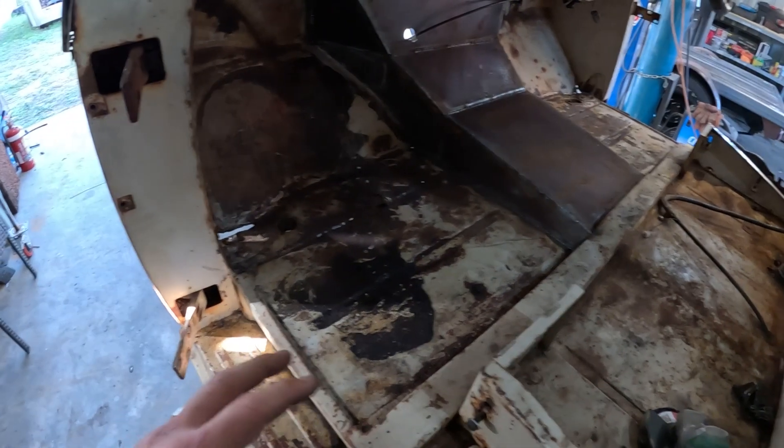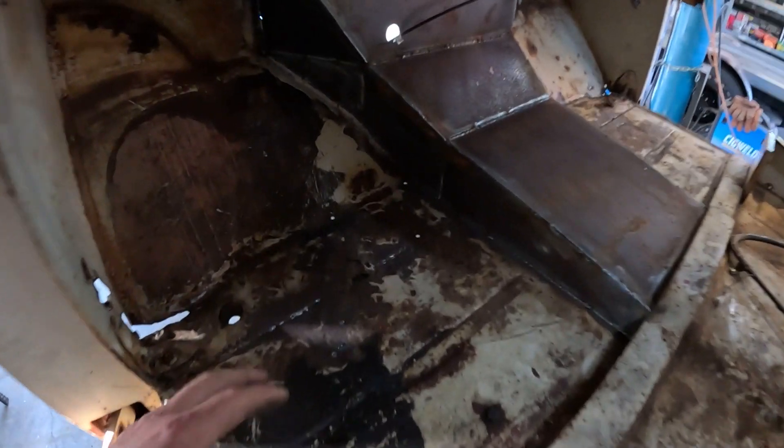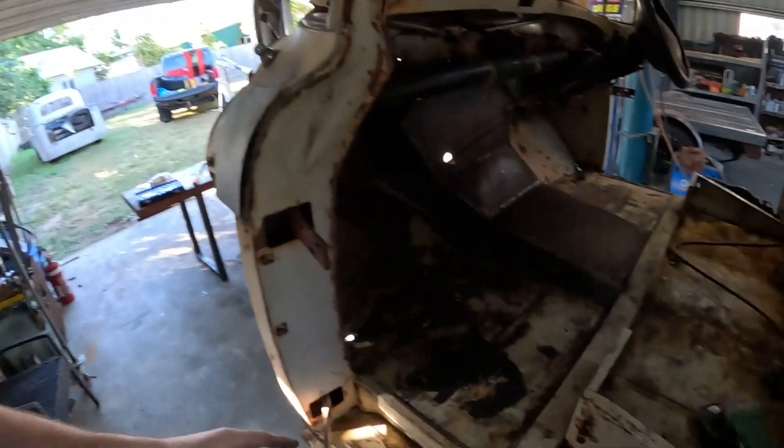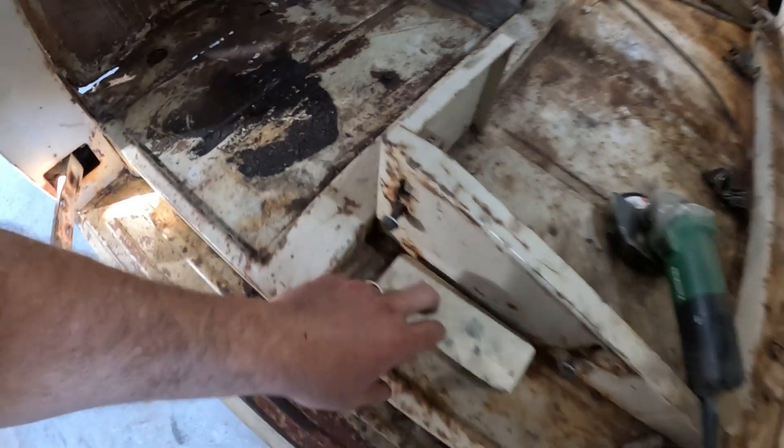I want to try something new — a technique I haven't used before. This bit of bronze brass, I want to use it to go from the underside of the floor pan and MIG weld from the topside. Not sure if it's going to work. These floor pans are a little bit thin, got a few speed holes in them, but in the interest of saving time and saving the customer some money, that's what we've decided to go with. Going to give it a buff, get the rust and crap off, and see if this trick works.